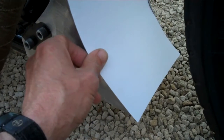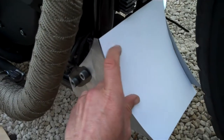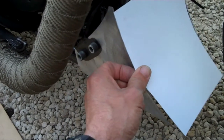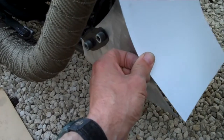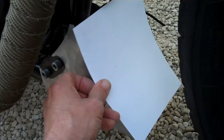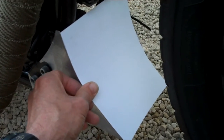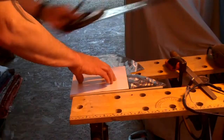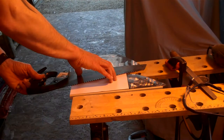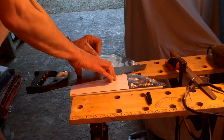A bit hard to get it to stay there, but that's pretty much it. I've come up a bit because what I want to do is notch around the frame, which will look quite trick - just sort of makes it look a bit snipped in. But that's pretty much the right size. That gives me about 1.5mm either side of these outside, so that would just be a nice grindable space. Don't want to make a complete butt joint because it's just not secure - overlap it a little bit and then it'll be a nice sealed joint. Right, cut this out of steel.